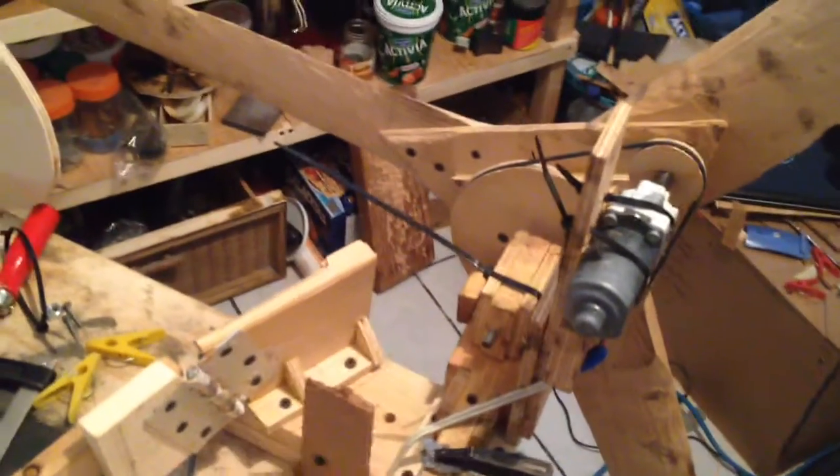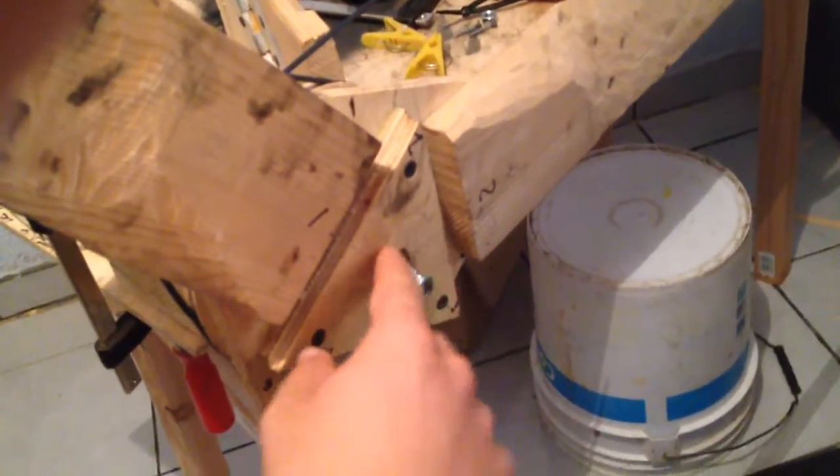The most expensive piece of this turbine is an eight-foot one-by-four pine board — I made the blades from it, almost six feet worth of wood for the blades. Then I used it for the center piece and some of the pivots. I only used about one eight-foot one-by-four. The other material I used was three-eighths inch plywood for the center hub — a triangle in the center that the three blades are screwed into.